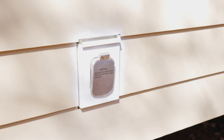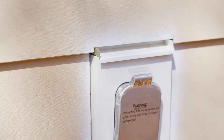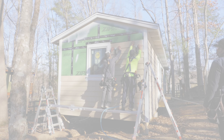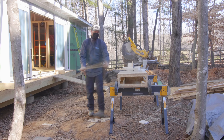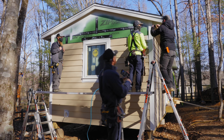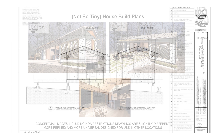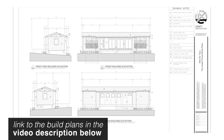On the top edge we left about a 3/8-inch gap above the flashing so water pooling there won't contact that edge. We continued up to the bottom edge of the window, which was about as far as we got on the first day. Because the siding boards came in 16-foot lengths and all my sections were 12 feet or less, I had a lot of four-foot off cuts — but this worked out well because the lengths needed next to the windows were almost exactly four feet. This really came down to great design by our architect Rick Kaysby, which minimized waste and saved money.